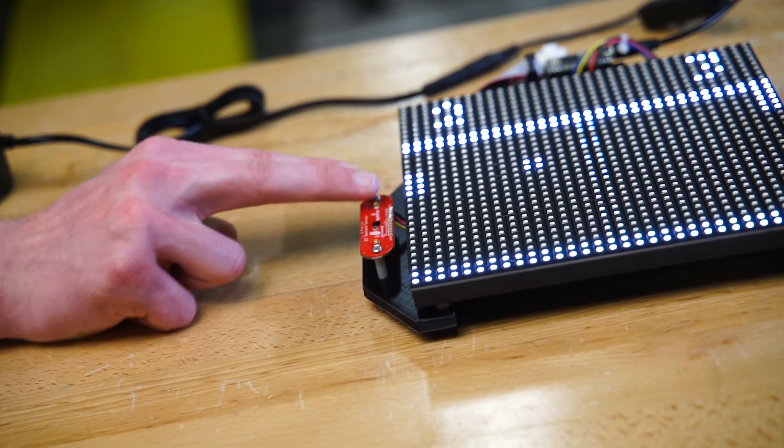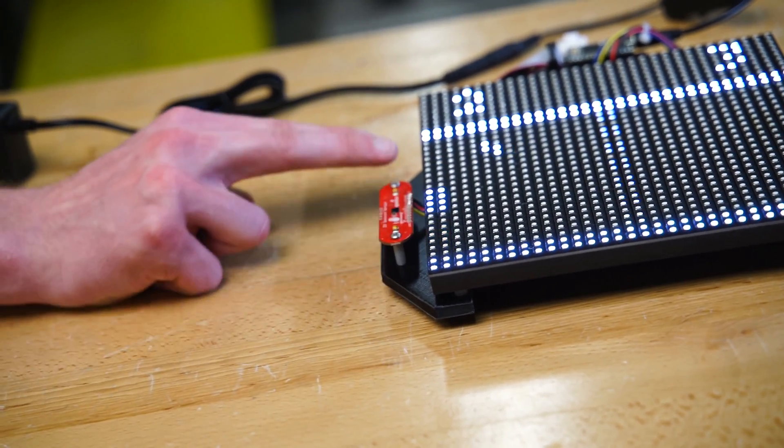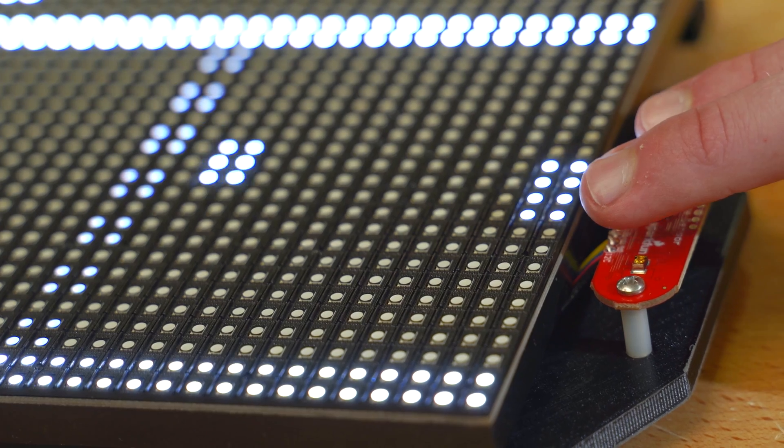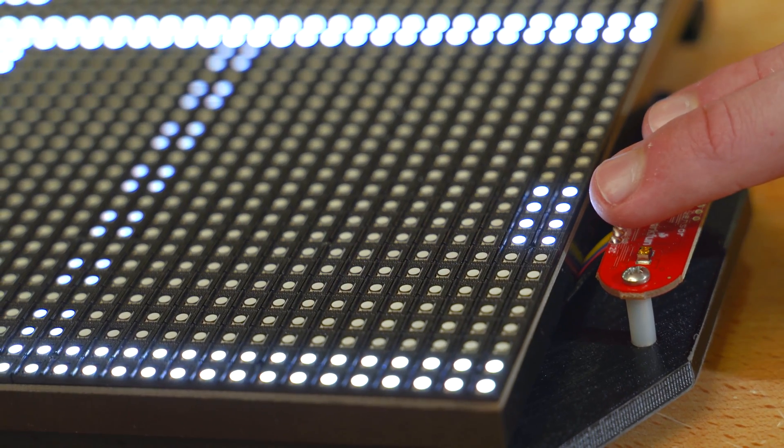The sensor is actually really cool. It uses two infrared LEDs that blast light up to a nearby object. The object then reflects light back to a sensor that's between the LEDs, and that sensor — the infrared receiver — looks for changes in light intensity or changes in phase from the light. From that, we can determine where the object is in relation to the sensor itself.